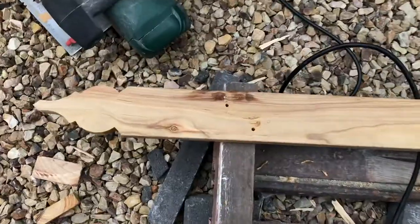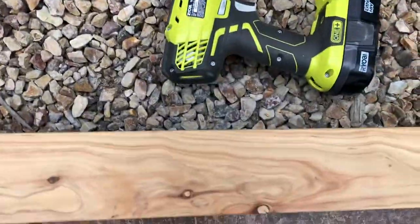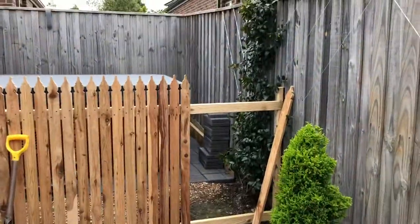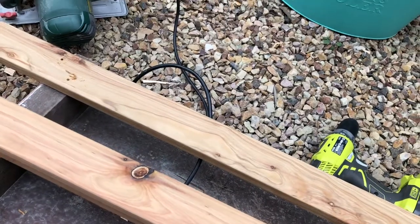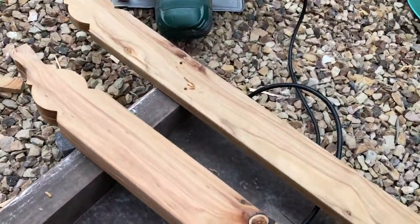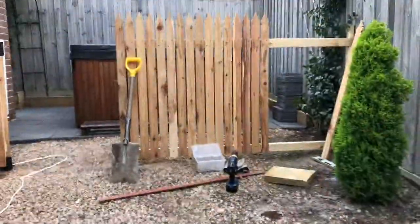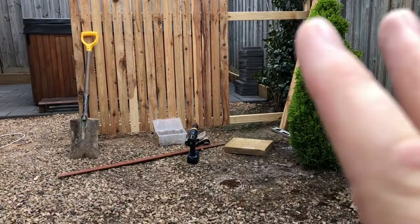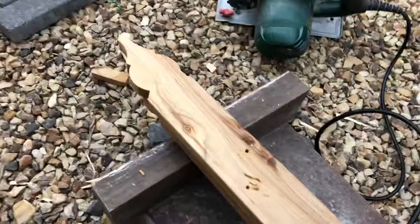How to mount your palings onto the paling fence. I've got a master board here — you can see where I've lined up where the two screws need to be in the top and the one screw in the bottom. I'm pre-drilling these with a drill so I don't want them to split. I'm not bothering to pre-drill the pine as it's thick enough. I get a few of the undrilled boards, stick them on, get them perfectly lined up — height, length, everything — then put the master back on top and drill my holes through, so they all end up exactly the same. The finished job will all be in line and in the right spot. As long as you've got your boards parallel and level, the holes will line up all the way across.